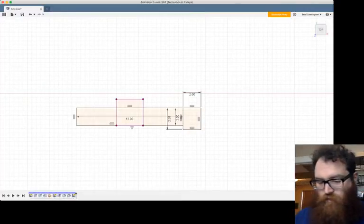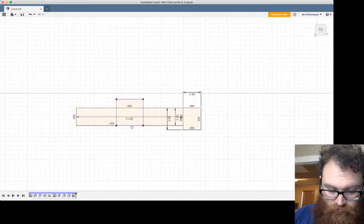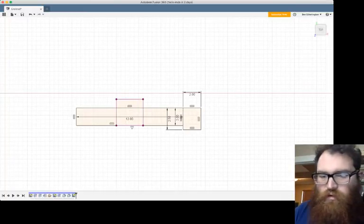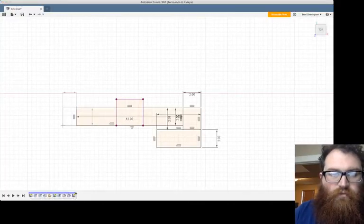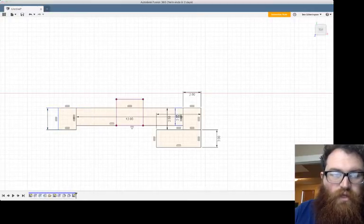Yeah, all right. So the narrow side is going to be on that side. The amount of room I have is like 3 millimeters. Okay, cool. So what I'm looking at is just the components here are going to mean that one finger is going to be shorter than the other. Okay, so this needs to be like 2 by 5. I guess I could mirror that if I built a center line, but it's just as easy to say 2.5. Actually, I'll do this. Let's just build this. And then we'll do this here so that if we have to come and change this gap, we can.